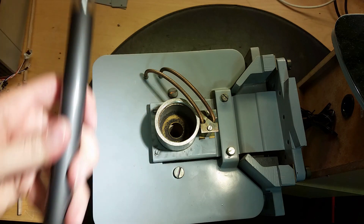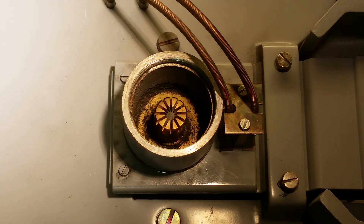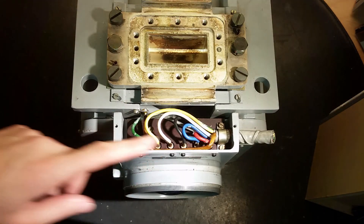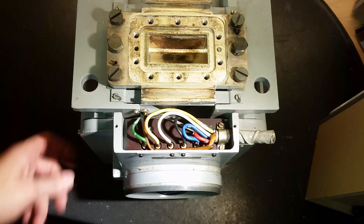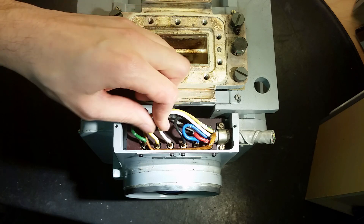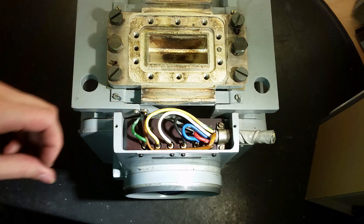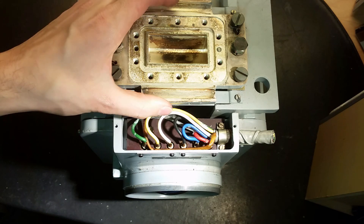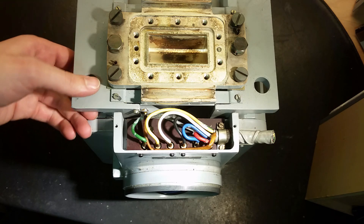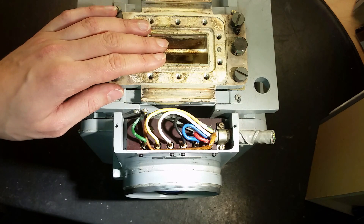This is like a 15-watt tube I think - I'll put the datasheet here so you can see the correct power for this tube. Now I placed the vacuum tube back in place - you can see the whole brass part is inside of this chamber, where it gets cooled off by the air. Here you can see the connection block that goes to this connector here, and this wire connected to this port here. So it's just like two wires for the filament, one cathode, maybe two grids, and anode. Doesn't need so many specialized components for this type of application. These are quite reliable, are still used in some kind of satellites and high-power applications. Pretty interesting unit - just one tube, some high voltage to it, and it can amplify microwave signals.